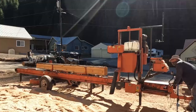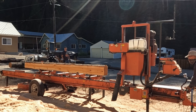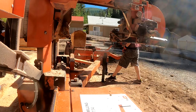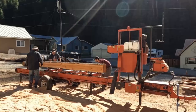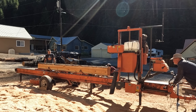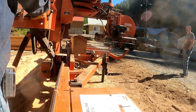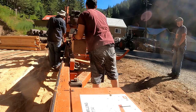But for the most part, if you put your stress so that it is what I would call vertical when you're milling your 1x6s, that means it's going up and down and you're taking 1x6s off one at a time, then it will present itself in the lumber with a face bend. In other words, it will lift up kind of in the middle or on the ends, but it won't crook or crown to the side. And that's okay, because when you're milling flooring or paneling, you're going to nail it down flat anyway. If you have a crown though, that's going to have to be edged off, otherwise your boards aren't going to meet up flat against each other. So that's what I'm looking for.